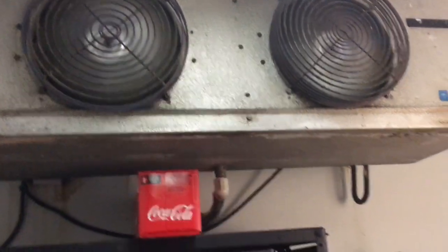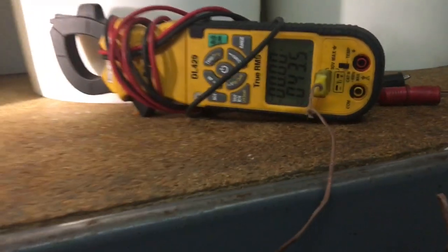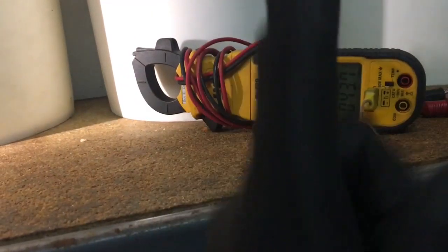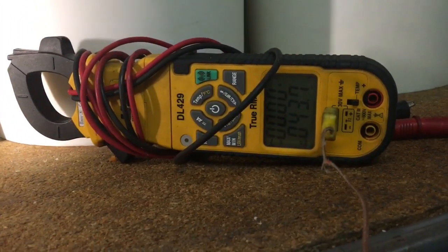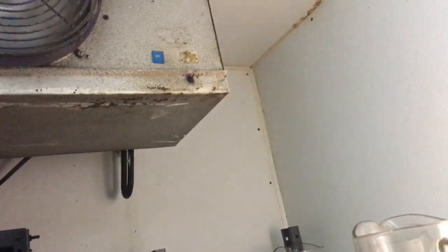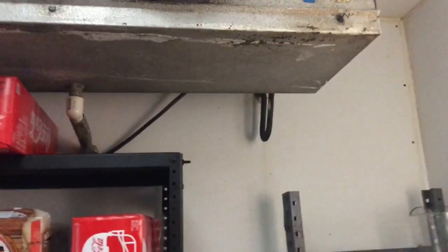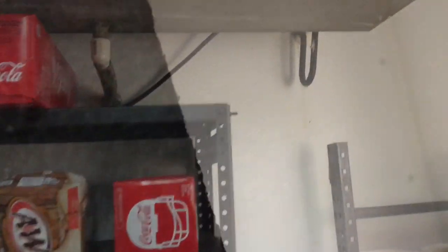Just came off the roof from washing the coil. So it's two coils cleaned — the evaporator cleaned and then the condenser cleaned, that's all I've done so far. 43.7 — so we're pulling down. I'm going to hook up some probes up here and see if there's a tap to check the superheat on this. If not, we'll have to convert the temperatures. Just curious to see what it's set at up here on the coil.